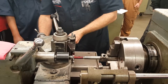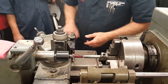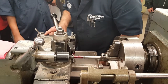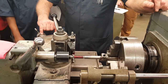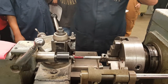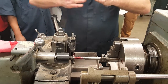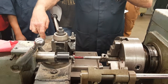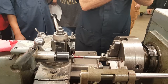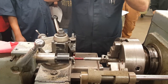So I'm going to set this to zero again. Now I don't completely go all the way with this - I'll get to the point where I'm about five thousandths left, and then I'll use this one to go straight in. The whole purpose of that is because you're cutting a thread using the compound rest, so it's going that way and you're always cutting on this face. At the very end, I'm going to go straight in and clean up that face too - flatten it - so you get both faces.